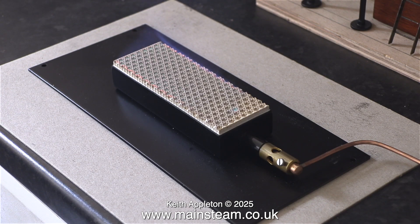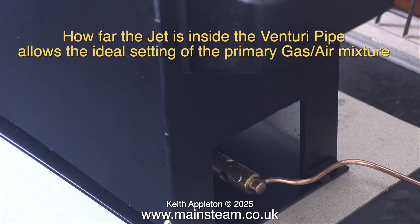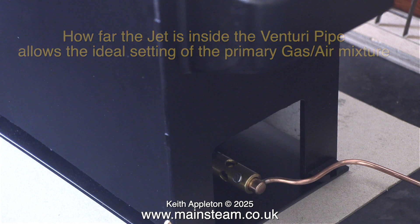In the instruction sheet, these Bix burners say you need a lot of little blue triangles — that is the ideal for this particular burner. The jet holder is almost all the way into the venturi. On the burners fitted to the 501 boilers, the jet is slightly further out. Once I found the optimum position for the gas jet to give those small blue triangles, I marked it using a felt tip pen.